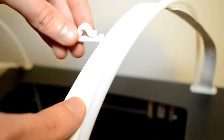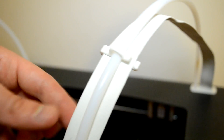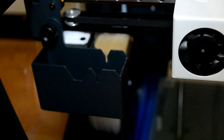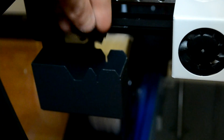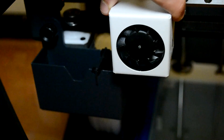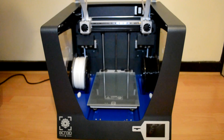After putting in the teflon tube, it's time to attach this little clip — it's really easy. Just put it on the cable and on the teflon tube and it will keep the cable in the same position as the teflon tube so it won't move around in the printer. Last but not least, put this cleaning rubber inside this little cart so every time the extruder moves to change color, it will clean the nozzle.